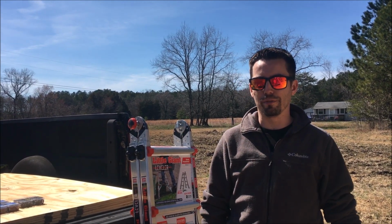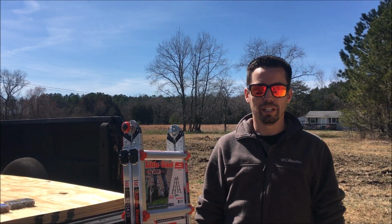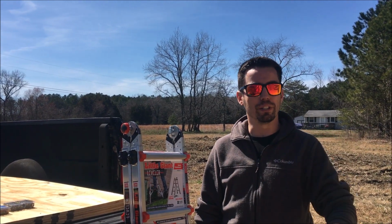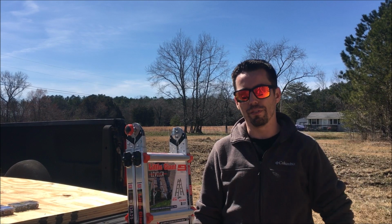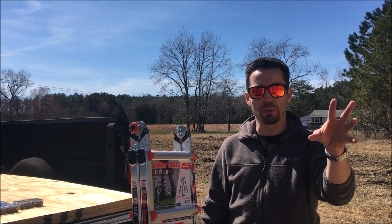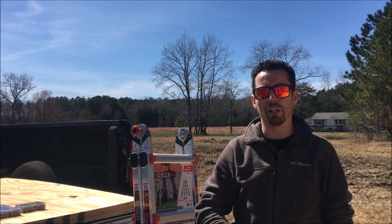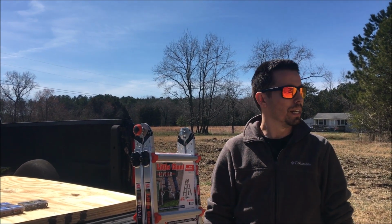Well, this is going to be our third video, and hopefully you guys have been learning from us, or maybe you can teach us something. But today we're going to try and finish up the header and the window section of the shed. We're going to try and put the plywood on the outside of the structure, and we're going to stiffen up some of the corners of the structure with some additional screws.